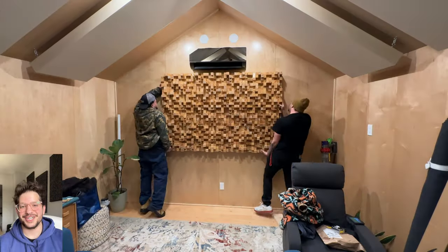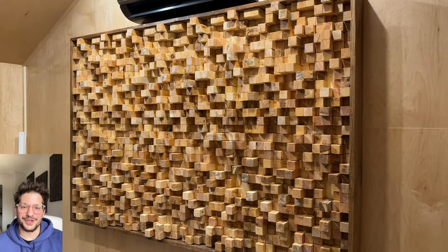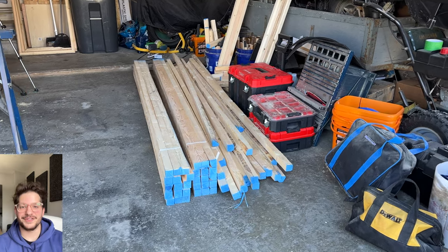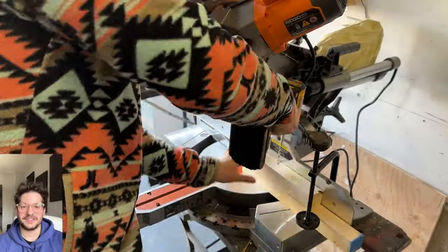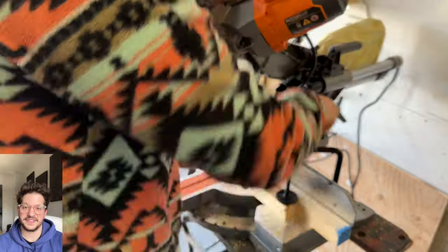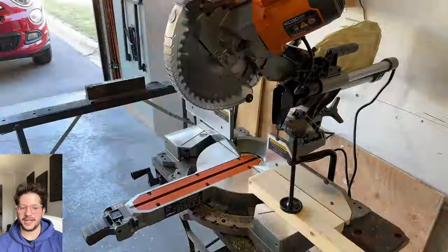Please enjoy watching and subscribe for more studio building and home studio acoustics. So we are starting off with our lumber — we are using 2x2x8 lumber, so our blocks are going to be that size. Right now I'm setting up my stop block on my saw to make sure all of my cuts are going to be nice and consistent, so I can just butt up my piece of wood against my stop block and do all of my cuts.